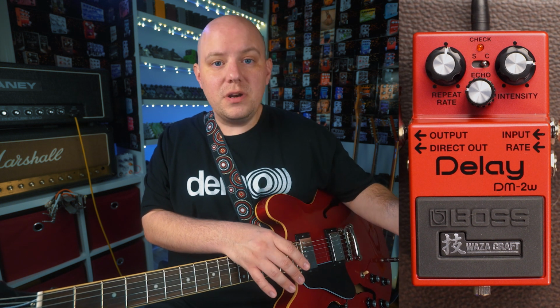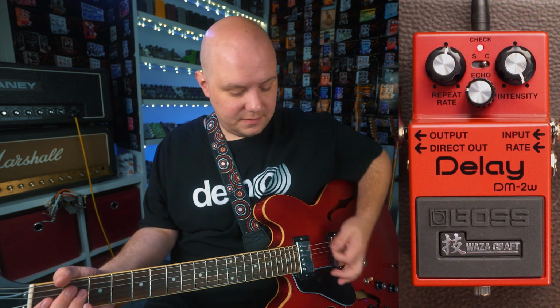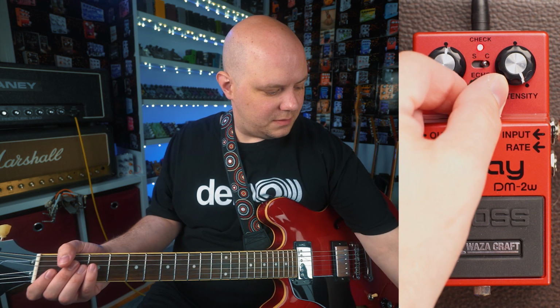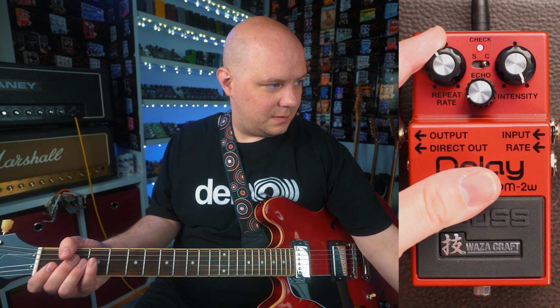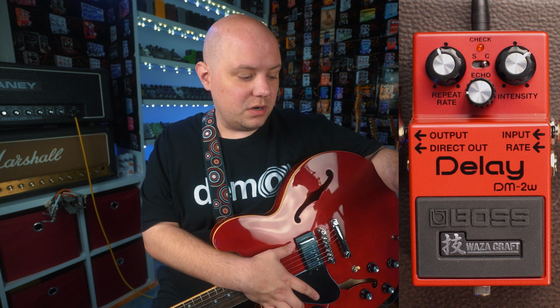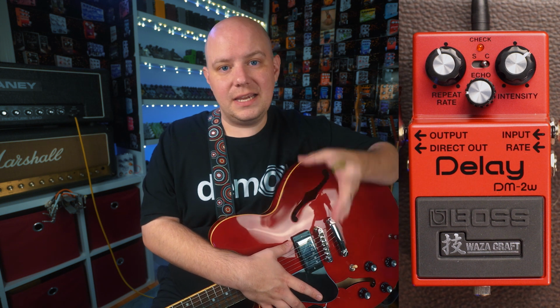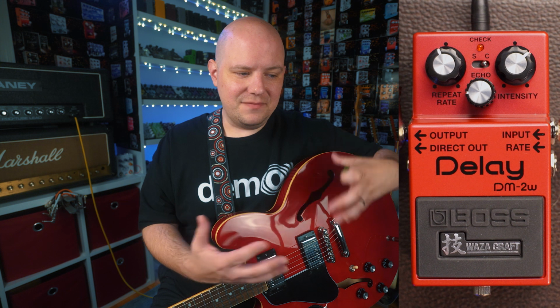So that was with the intensity control at the lower side of oscillation, but if you turn it up even more, your oscillation starts to happen even quicker. So here is on full 100%. As you heard there, with the intensity control all the way up at 100%, the self-oscillation starts almost immediately and it gets really loud and really intense. And even low settings on the echo knob really don't put it all the way in the background. It dominates all your signal.